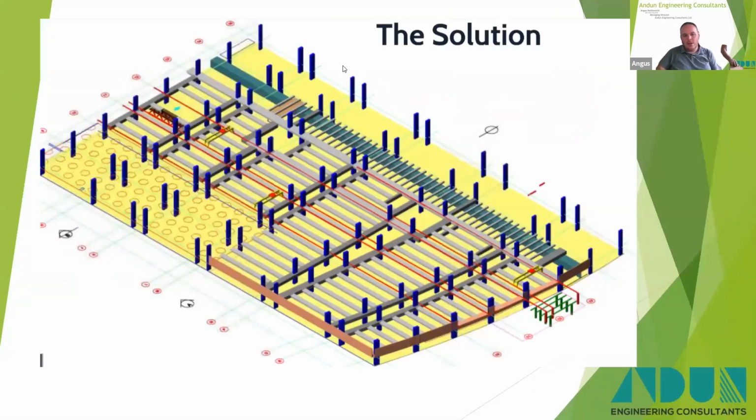So again, looking crudely through the structure, the level to come out is those grey beams. The yellow level below is the floor, which is of limited capacity. And then we've got to take all of that structure there out. So you can see some fairly hefty beams in there.